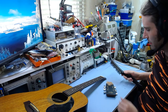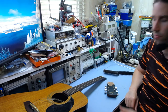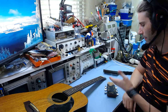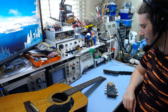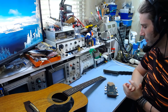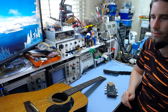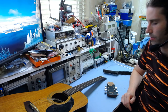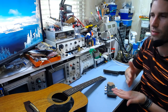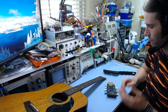I've got a wire brush here, and I've just been scraping away at this to try and get the old glue residue off, because it gets in the way of joining everything back together again. It leaves a rough surface that doesn't fully go back together smoothly, and also, of course, you're putting fresh glue on old glue that's already come off, already broken. It's not particularly structurally sound. You want to glue directly to the wood if you can.